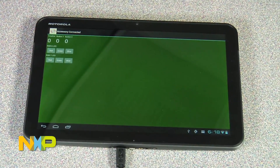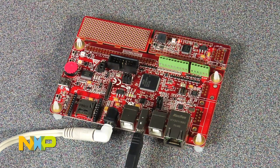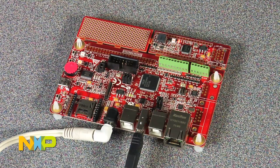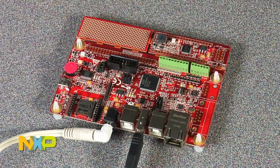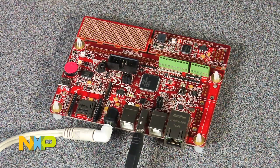When Google opened up the Android spec to allow people to connect to Android devices, it is through a USB host interface, since Android devices are in USB device mode. Eventually they may be USB host, and we're future-proofing this board so we have the ability to connect in device or in host mode.